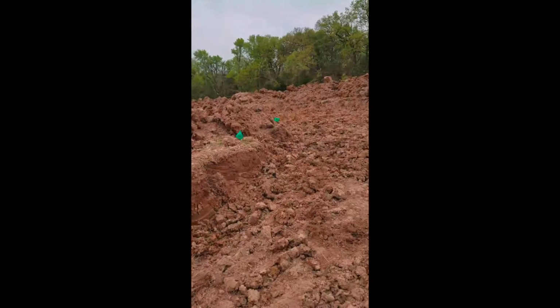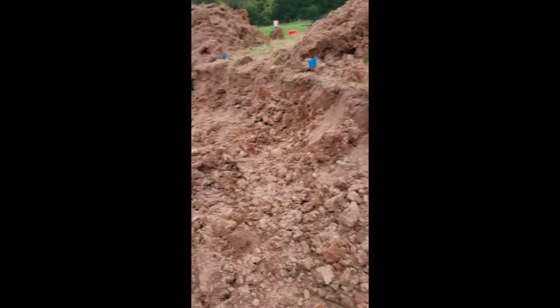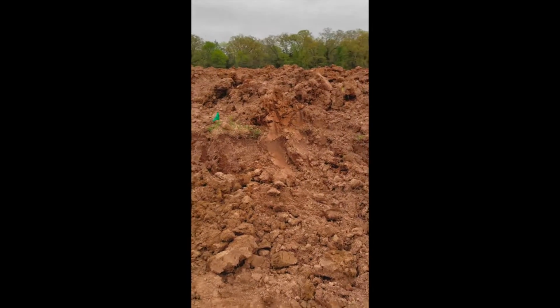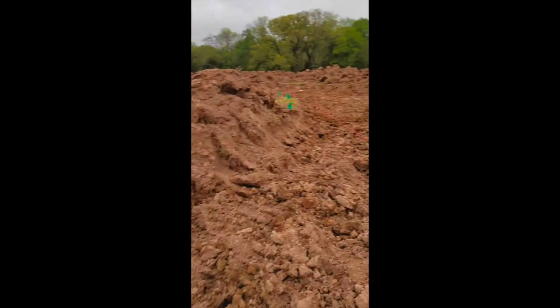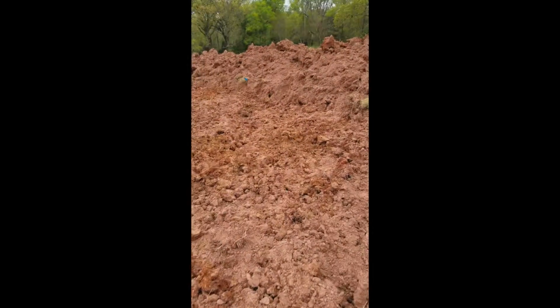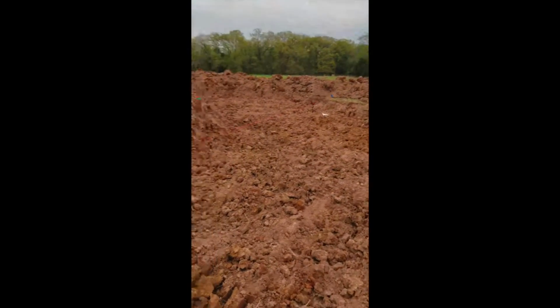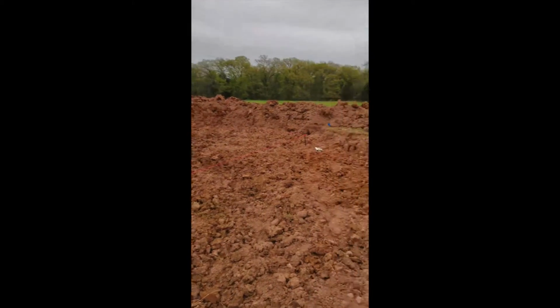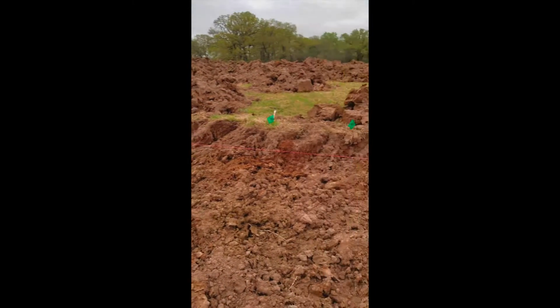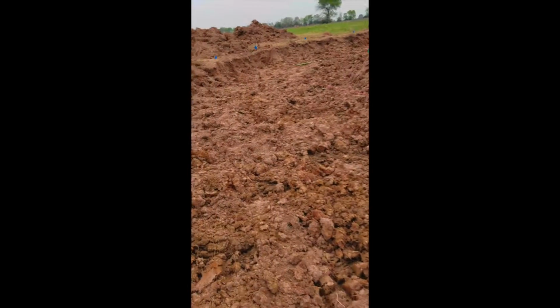And then if the soil expands and contracts, which it looks like I have like a 30% expansive contraction for both clays. I was thinking that maybe the bottom layer, the yellow clay, because it was drying out so fast, would be less expansive, have less shrink swell capabilities. But as it turns out, I think just because it was lower in the ground, it started out drier to begin with. And it looks like they still have the same sort of shrink swell capacity of about 30%. So when it's dry, it's like 1 inch. When it's wet, it's 1.3 inches.